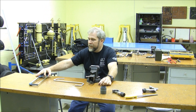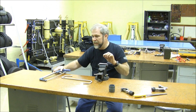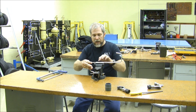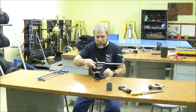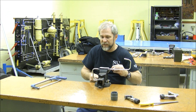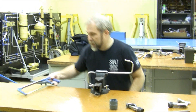To begin with on a hacksaw, if you are going to use a hacksaw you need to make sure you have very fine teeth on your hacksaw, because if they're not fine enough they'll tear the delicate edges of the tube. Obviously you're going to need to support the tube somehow when you work with it, but we're going to use the vise — it's got some nice aluminum jaw plates to keep from damaging the sides of the tube. Just chuck it up tight enough to hold it.